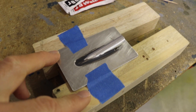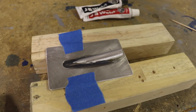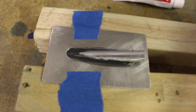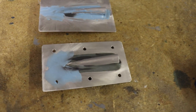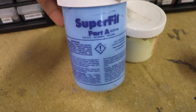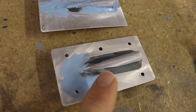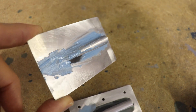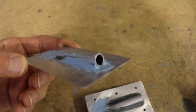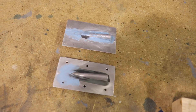I taped the plate to two blocks to hold it, with another little block underneath to hold the tube in the correct position while I apply the JB Weld. I mix up the JB Weld and use a toothpick to put it around the joint. Once the JB Weld is dry I apply a little bit of super fill — it's a two-part filler, real lightweight and easy to sand. I mix some up and feather in all the edges. Then I sand it down and you have your exit pieces. You can use any kind of Bondo or similar product for that step.